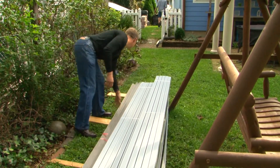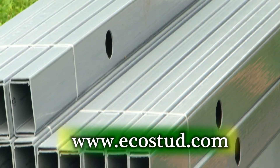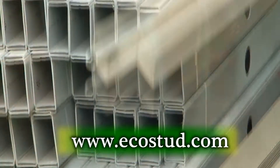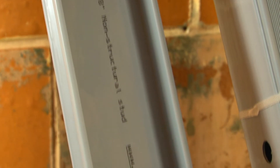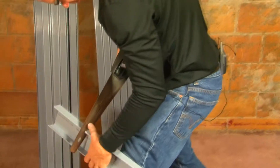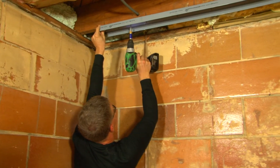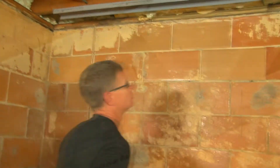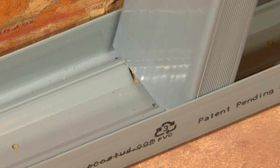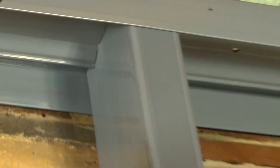All of this helped me understand how Eric's innovative new product, EcoStud, could help in our basement retrofit. EcoStud is a recycled plastic stud system which can be used to fur out basement walls. The plastic studs work better than either steel studs or wood, since they wick less heat from the inside to the masonry walls than steel, and don't absorb moisture or rot like wood. Eric showed me how the track and stud system meant an easy installation, and I was soon on my way.